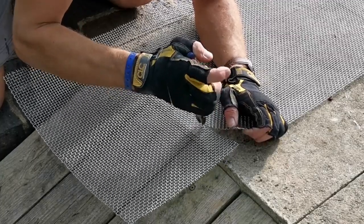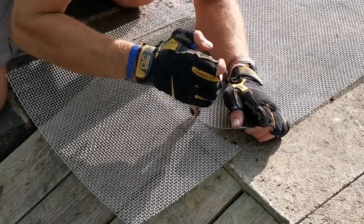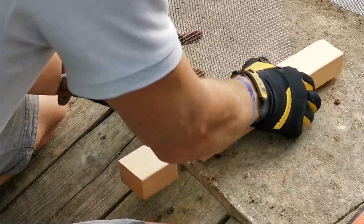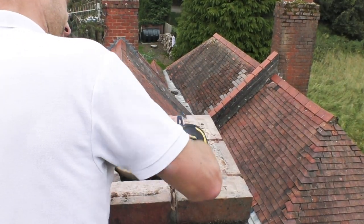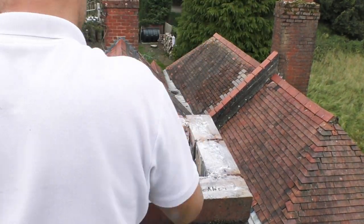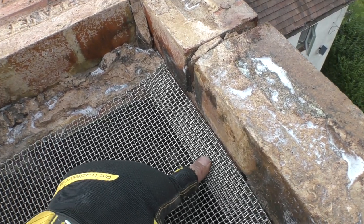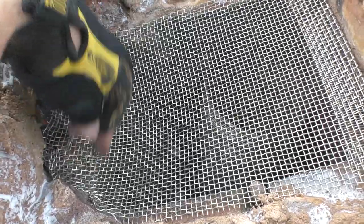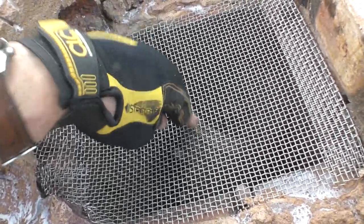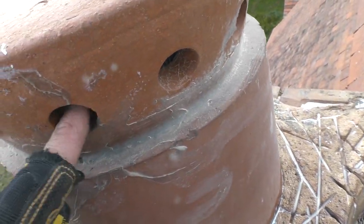My master plan: I've got this stainless steel mesh from years ago when I lived in London, originally used on air bricks to stop rodents getting in, since mice can crawl through holes the size of a big biro. I'm going to lay this inside the chimney as a barrier to stop the sand and cement render mix falling down the chimney before it sets. I wouldn't do this for an active chimney as it could get creosoted up and make sweeping more difficult. Then I applied a quick coat of watered-down super PVA to ensure the surface was dust-free before rendering. I doubled up the mesh at the point where it needs the most strength, as there's no lip for the concrete to sit on, and bashed the surplus into the corners - really strong now.